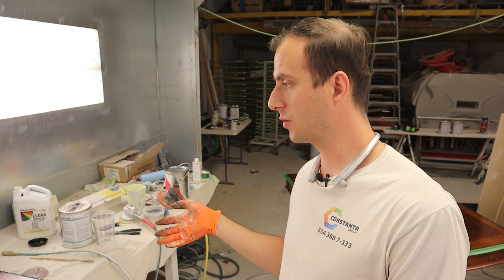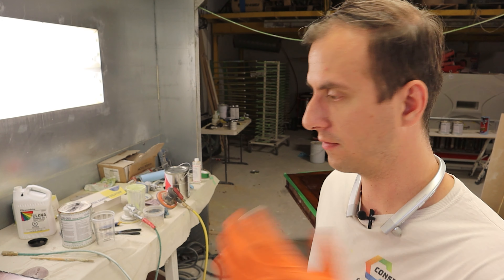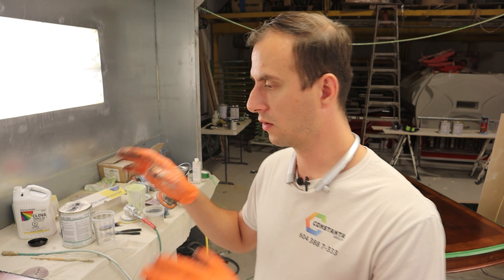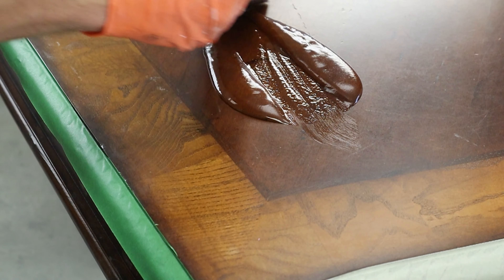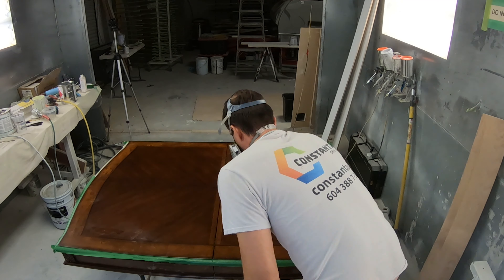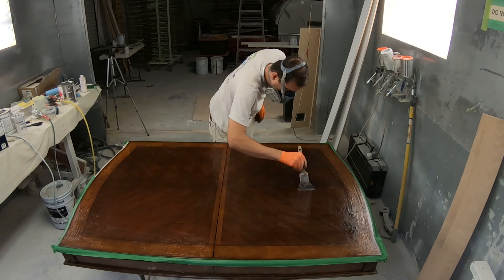I got some samples. It looks pretty good to me — it is slightly different than the original color; I would say it's 95 out of 100, but I'm pretty happy with that. Everything's going to look consistent, so it's going to look like a brand new table. I'm going to use my stripper, strip it all down, get rid of the finish. I try to spread the stripper nice and even, and also leave a pretty thick film on it, so the layer can't be really thin, otherwise it won't take the finish off.